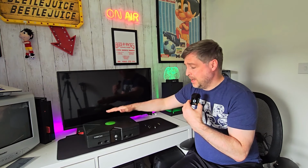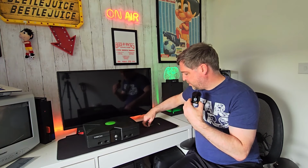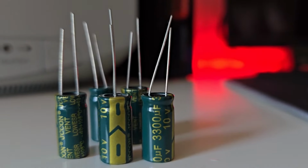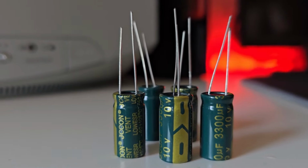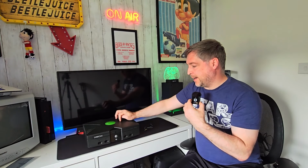Today's video is going to be replacing the power line caps, I think? I've got a bunch of them here, about 5 capacitors. Now, these are 3300 UF 10 volt. And when I looked at them the other day, I saw they were quite, well, bulging, should we say.